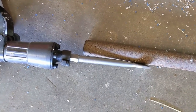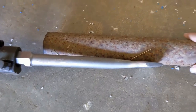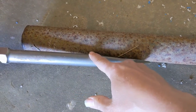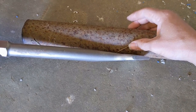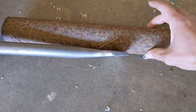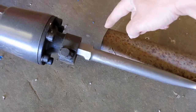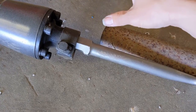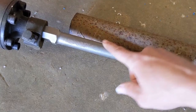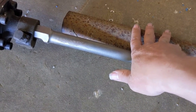This is the layout. I'm not really following any particular plan or anything. Just kind of making this up as I go. So I'm picturing I'll kind of weld it along this side here, and have a little bit extended out from the bottom. I'm going to weld a cap on the end of that using mild steel, so I'll have that to rest against the T-post. And then this will be oscillating back and forth, driving this tube up and down, and that'll drive the T-post, in theory.